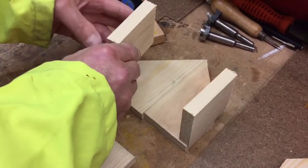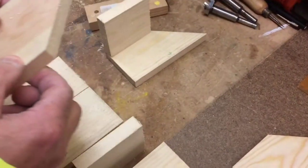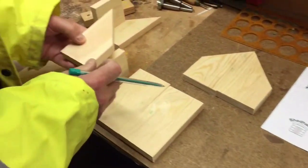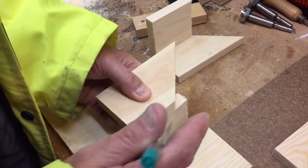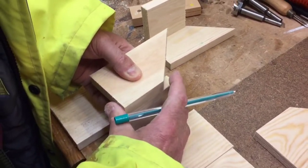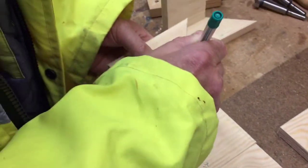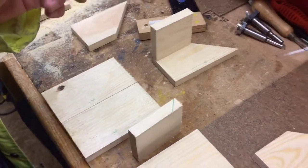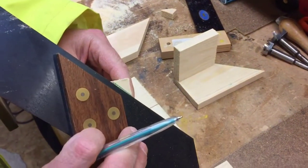These are the sides. Now the sides have to be at an angle. We place that on there neatly - it has to be flush there, level. Jake suggests: shouldn't you do this after you've marked and cut both of them? Possibly. I'm just trying to get the angle there. There's the angle - and that should be, if I get my mitre square - yes, 45 degrees.